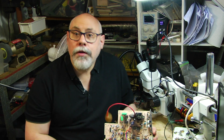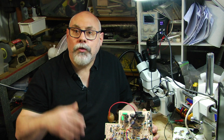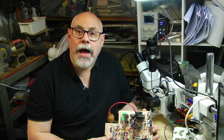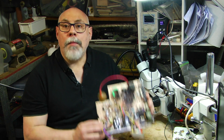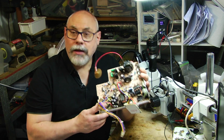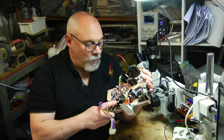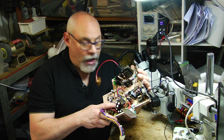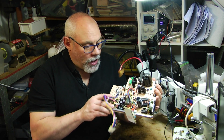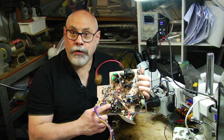So I have done quite a few recapping videos, and most of them are focused around logic boards, leaky surface mount electrolytic caps on a logic board. But there are problems with analog boards too. In actual fact, all capacitors will eventually fail, and in particular, capacitors made in the 90s have a higher likelihood of failing. And this classic analog board is a very good example of that.